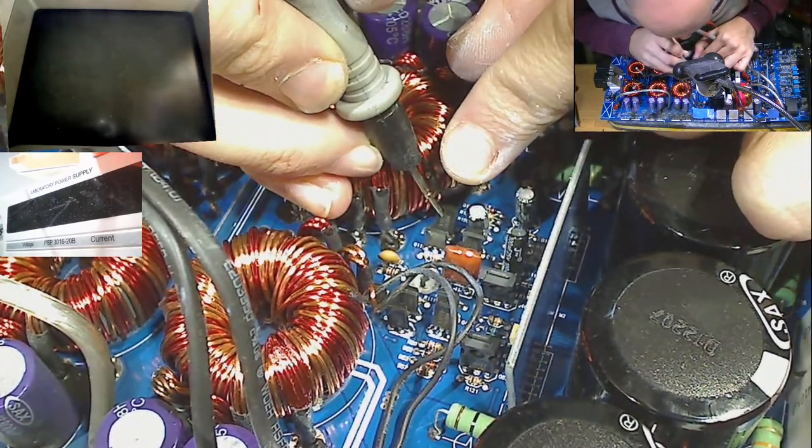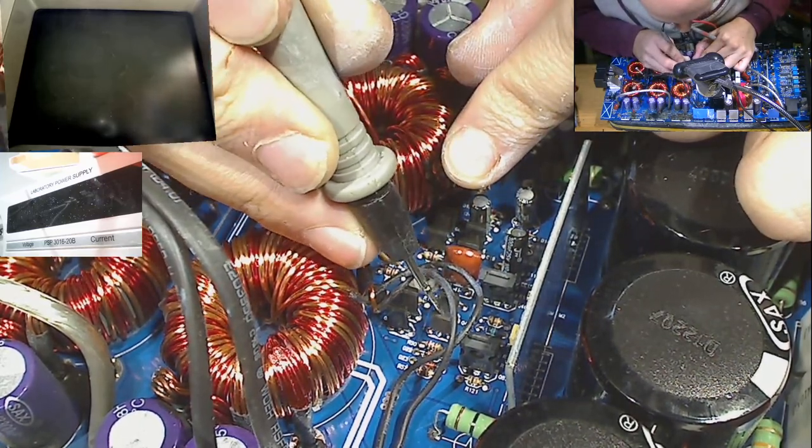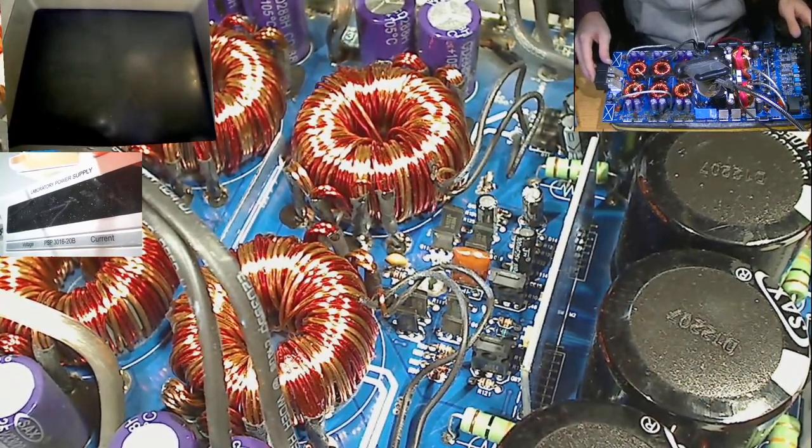The C part is the NPN, the A1023 is the PNP. These visibly look okay, which doesn't mean that they are okay, but it potentially means that the amplifier didn't fail too badly and didn't send too much of that current to the gate.